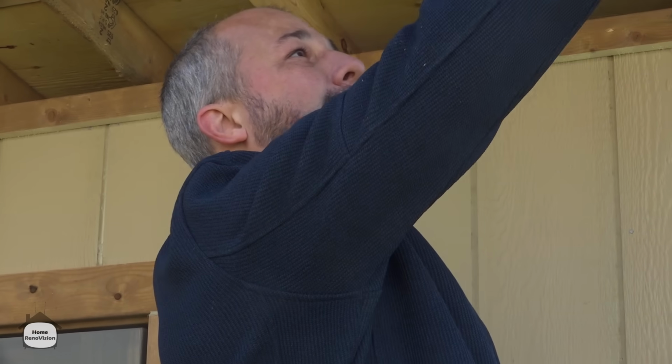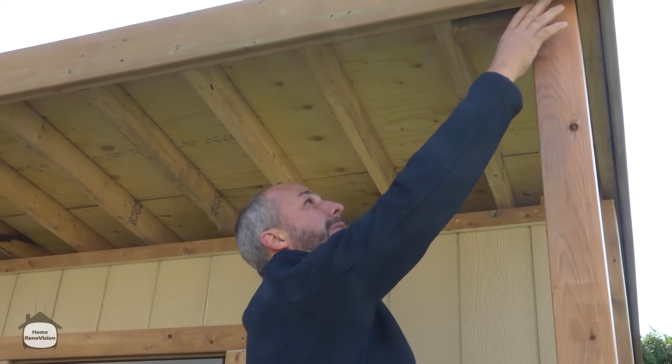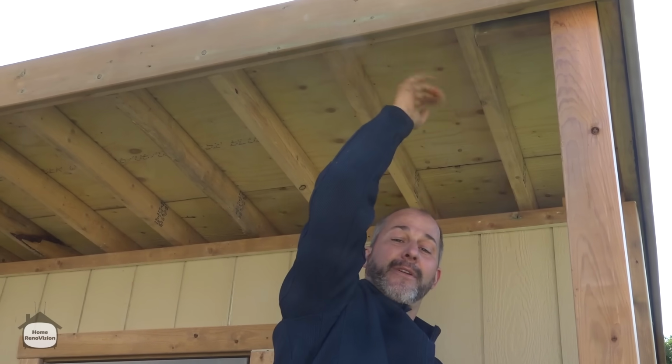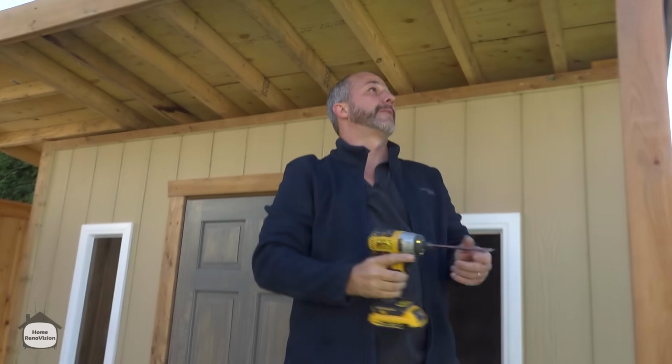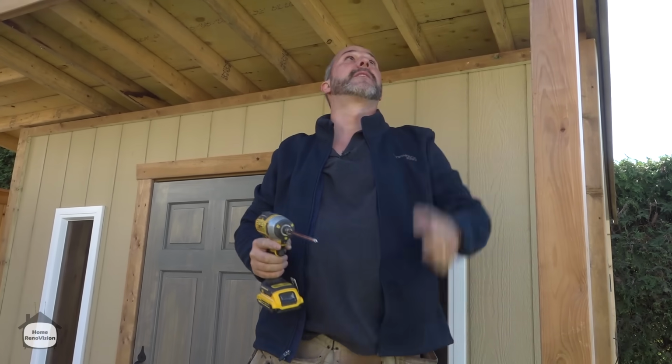Now what we've done is we've transferred the load responsibility from all the hardware in the corner and then added this one and added this one because the plywood above it is also nailed down. You understand the concept here? Because it's all attached and now it's blocked. Nothing can twist loose. It's going to be brilliant.